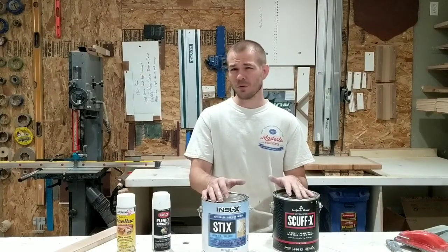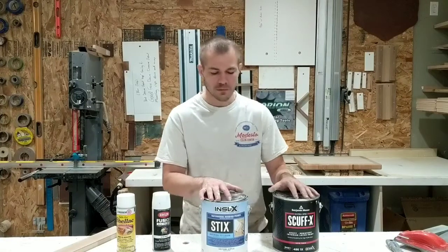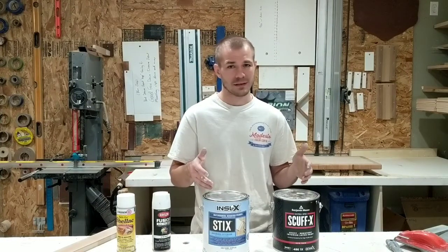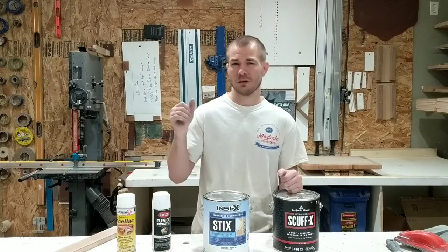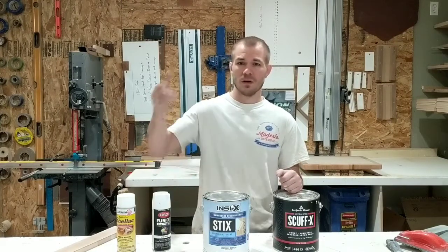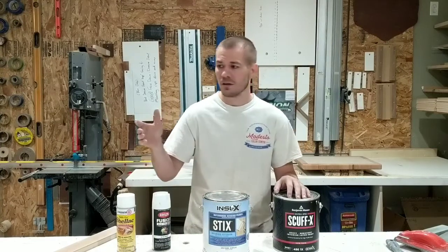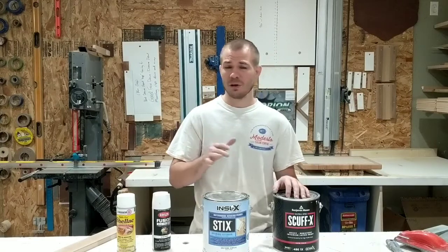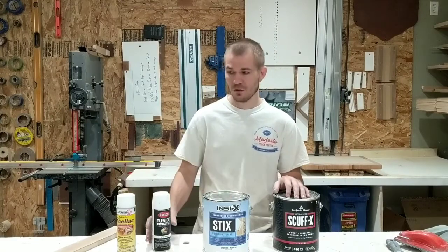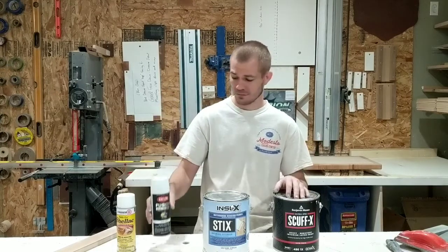It's not a cheap upgrade to go into a decent Airless sprayer that's going to give you good results. And high quality paints like these aren't cheap either. These are about 50 bucks a can. So after you get done priming your Airless spray pump with maybe a quart of material just lost, and by the time you get the thing dialed in, you might not be saving money at all by going Airless, and you could get a great finish just spraying out of cans.